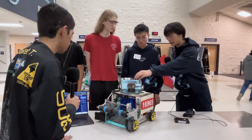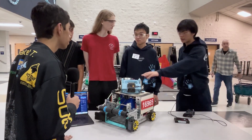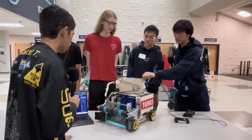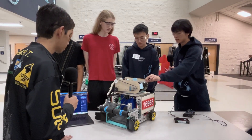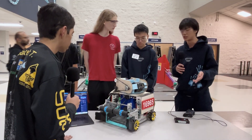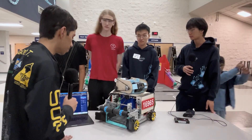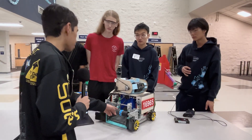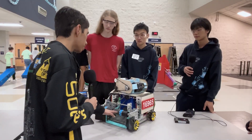The ball is able to travel through the whole system and go to a flywheel. We have a whole turret system here for counter-defense and better shooting. It's all powered by one 312 RPM motor with a 4-to-1 ratio, as well as a lazy Susan bearing. I want to talk a little more about these vectored wheels — what material are you running, and have you done any iterations on them?